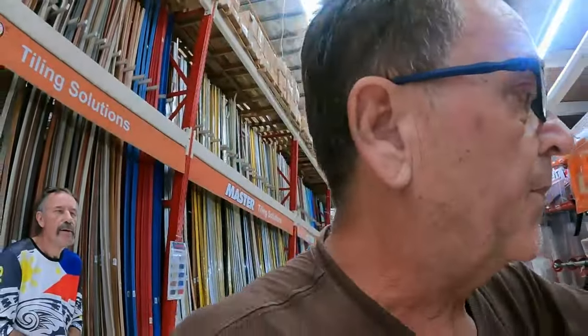Open up. What I've seen on one of the shorts is they put super glue in the screw holes where the actual hinges were. They can use talcum powder, you can use tissue. One guy, we've seen him even use cigarette ash, because all it is is a filler, and it's the super glue. Once that went in and dried, they could screw straight into it, and all the hinges were rock hard again. I'll show you when we get home.